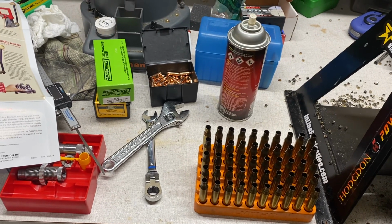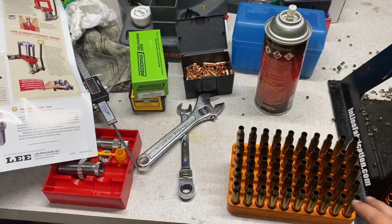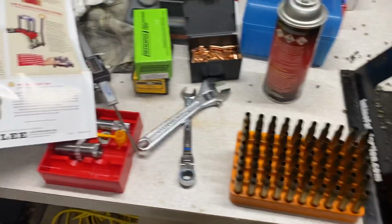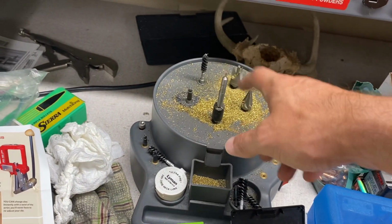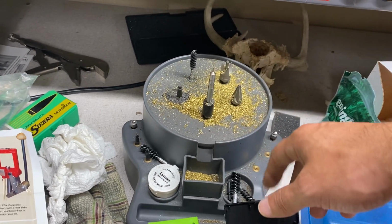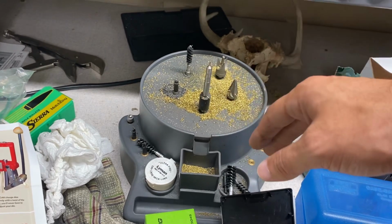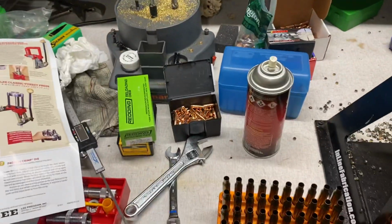Next video should be a continuation. I don't think I'm going to run through the trim, chamfer, and deburr. That's pretty straightforward stuff. You've seen me do this multiple times. I'm going to take this one out and put the 280 Remington Lee case length gauge in there, then run all the cases through. I'll clean the primer pockets. I'll trim, putting every single one on there, so if they need to trim, they'll trim whatever's over. And then I'll chamfer, deburr, run a brush through the neck, and we'll go.